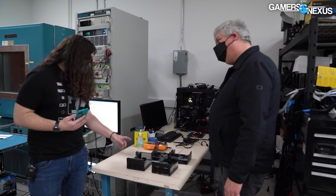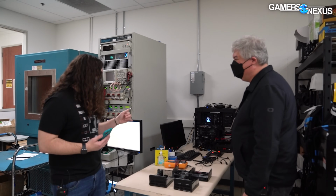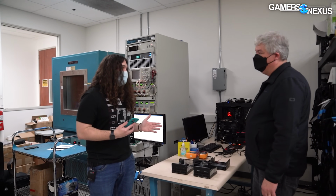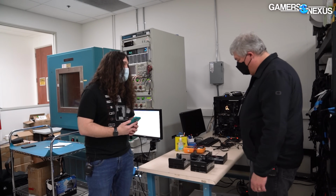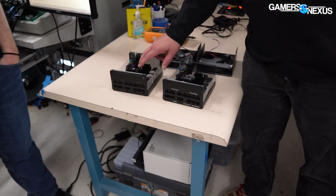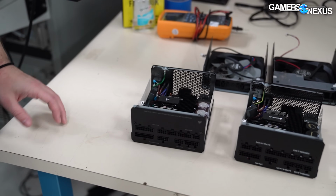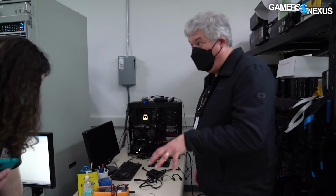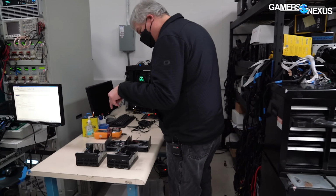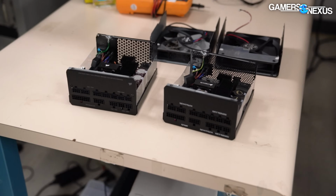And then in terms of resistance and why you would need it, I can rope this back into the misconceptions topic too. I've seen content where over the years people will replace power supply fans to try and get something maybe quieter or better, put Noctua in there, whatever. But if it's not as much static pressure, you'll find a lot of that air just kind of floats right out the back here, and then you run into that same problem you have with the tree canopy. So the air will just bounce off and go right out the back. It finds the path of least resistance. You need to push it down as hard as possible. That makes sense. Because you want it to go through the heat sinks, you want it to go into the PCB. Well, and through all of this, you've got adhesive. That's what I'm saying. It needs to go right through all that stuff. You don't want it bouncing.